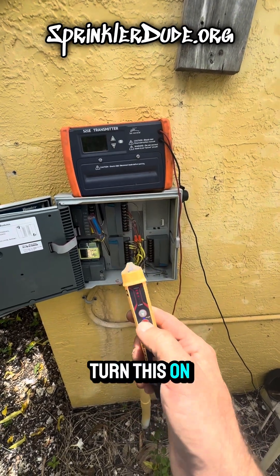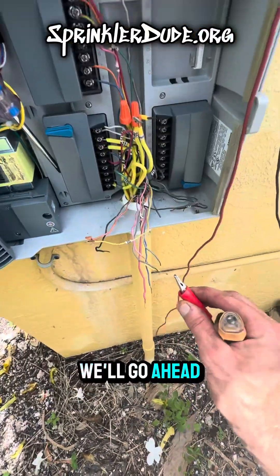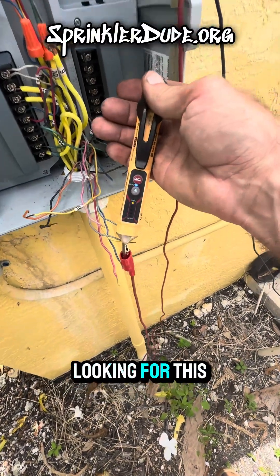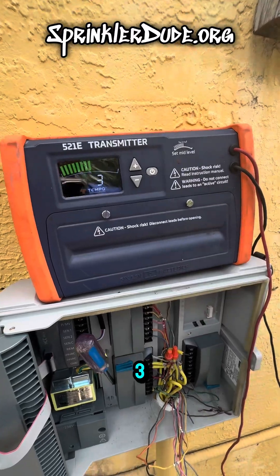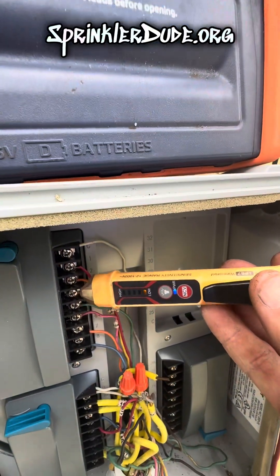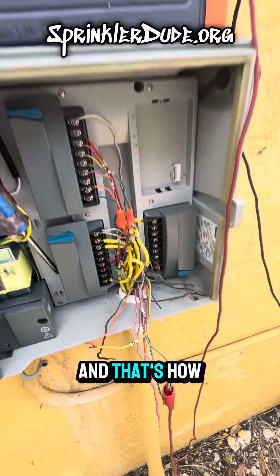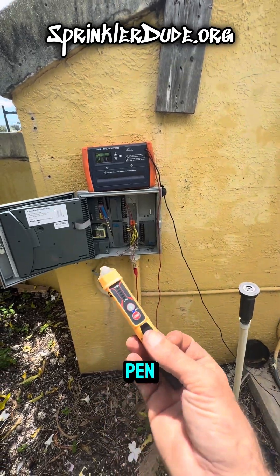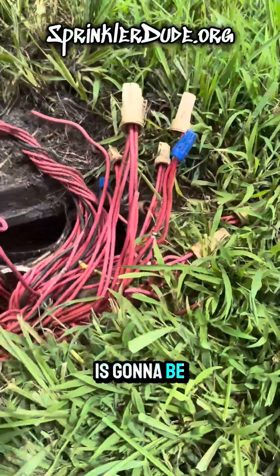When I turn this on and connect this locator to any one of these wires — we'll pick this one right here — when I get out to the other end, I'm going to be looking for this thing to light all the way up like you see there. Now if I give it just a bit more power and go to three, you'll see that it lights up pretty darn good. And if we go to other wires, it's not going to light up the same until we get to the closest wire — boom. And that's how I use the transmitter of my 521E locator and a low voltage pen to pinpoint which one of the wires in this whole mess of wires is going to be the right wire.